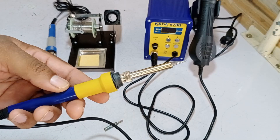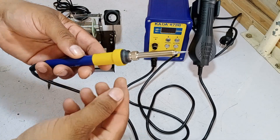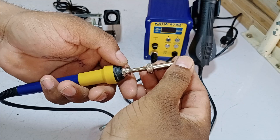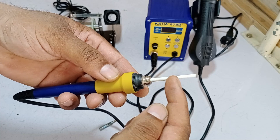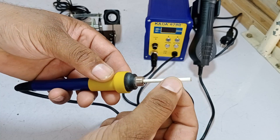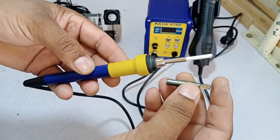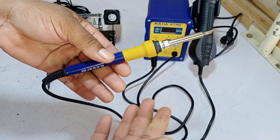In contrast, this new soldering iron has much better efficiency, and the chances of it getting damaged are much lower. Now let's open it up. You can see there's a nut here that controls how tight or loose its parts can be. We've opened the nut — here's the sleeve on top, and this is the tip attached to it. After that, we have the heating element. The heating element is cased in ceramic, which greatly improves its efficiency and reduces the chance of it burning out. We'll reattach the sleeve. When we install the knife bit, notice that it fits directly onto the heating element and goes much deeper, which means heat will transfer to the tip much faster. We've tightened it now, and it's ready to use.